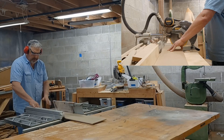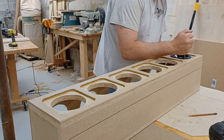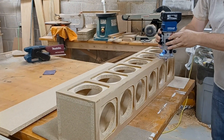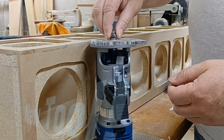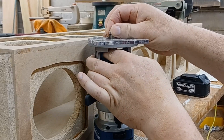I had to add two layers of 1/4 inch MDF to the two sides with the speakers so that the grill cloth wouldn't be touching the speaker surrounds. I could have machined a 1/4 inch deep opening in the speaker panels, but this is a lot easier to do. All this is really here for is to keep the cloth from contacting the speaker surround. I was able to apply a 1/4 inch round over to the long sides of the cabinet using my new Harbor Freight Tools cordless router, which takes a 1/4 inch shaft — so that's why I went with a 1/4 inch round over bit.